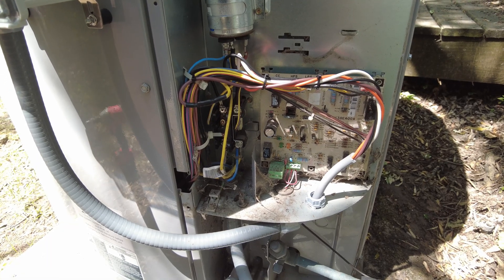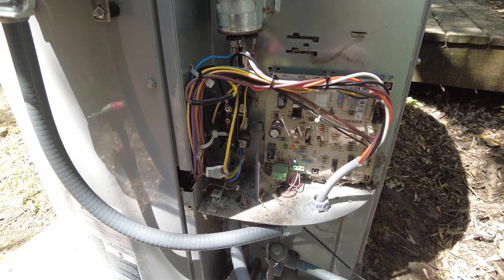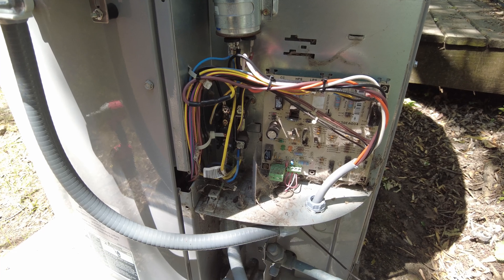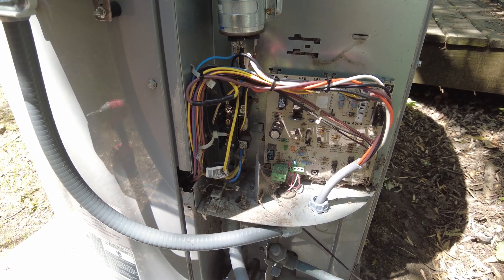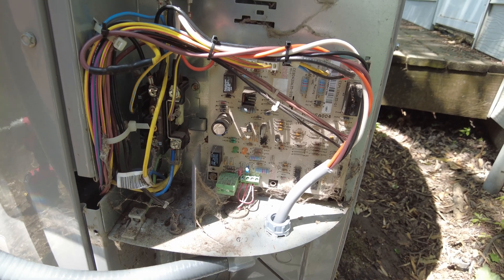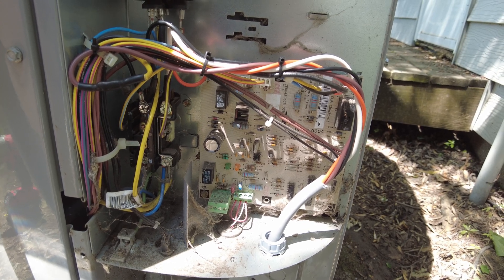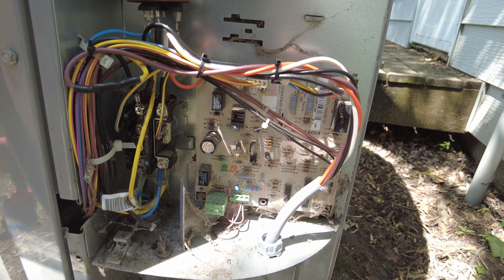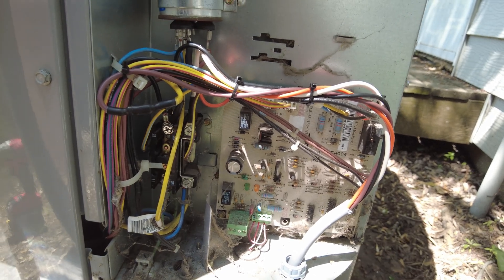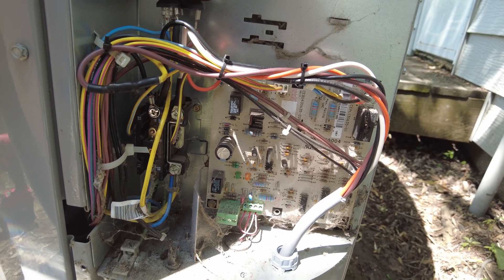One of the first things that was different — I've watched pretty much every Micro Air Easy Start install video on YouTube, and every single one was a generic install. However, as soon as I opened up my electrical compartment I saw a circuit board. The Micro Air website has brand-specific instructions including a Carrier set, but that's for a heat pump, not a regular AC condensing unit like mine, so it looked totally different and threw me off.